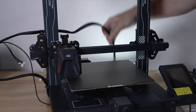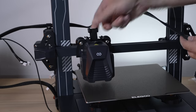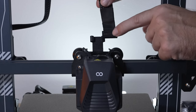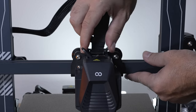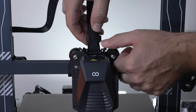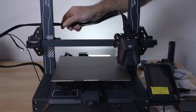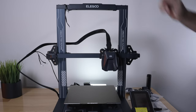Flip back around to the front — the other end of the cable connects to our hot end assembly. We also have a relief bracket that the cable goes into; there are two locking tabs to open, then take the cable and plug it in — it only goes one way, the little knob goes to the back. Push and it locks together. Now feed the cable into the relief bracket — go in one side, help the other side go in and flatten it out. Check that you've got enough length for travel — we have plenty here.